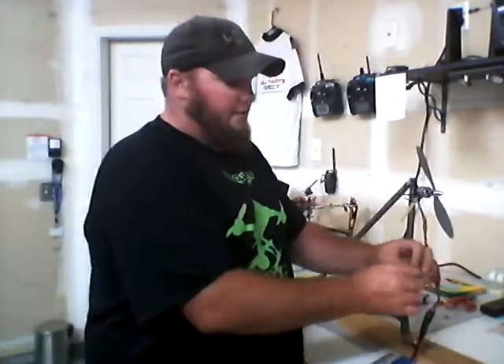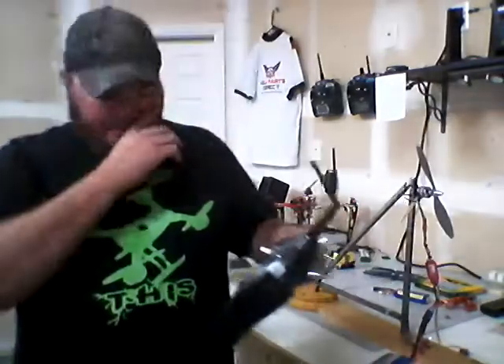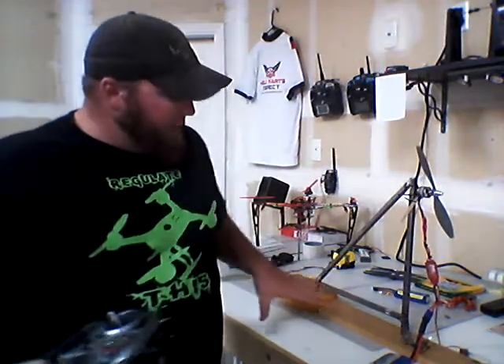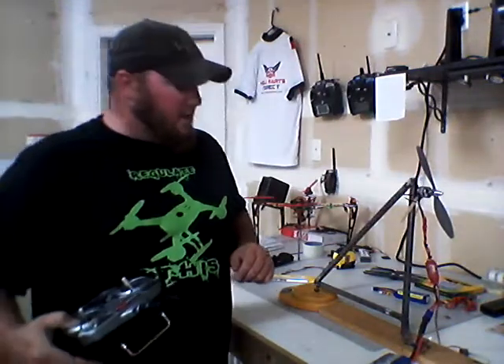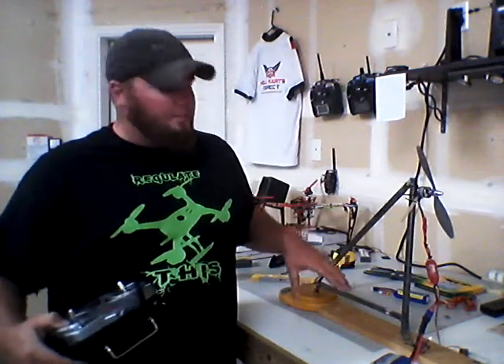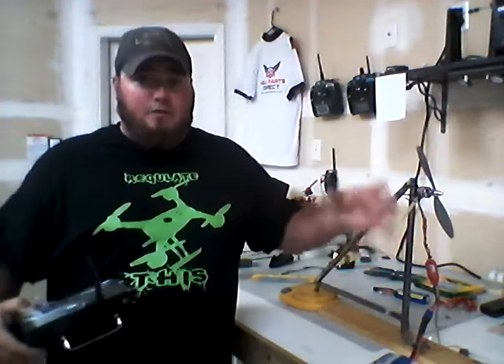I've got my little receiver down here — this is just my little test receiver, it's a four-channel Spektrum so that I can use my DX5. Everything's powered up and ready to go. One thing I would mention: if you build one of these, find a way to anchor this sucker down so that as you spin it up the sled doesn't start moving. Ask me how I know that — because at about a pound and a half of thrust this thing will start to slide. I've got a couple of holes in here and I'm going to make a mount for it with some dowels later on.